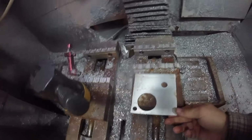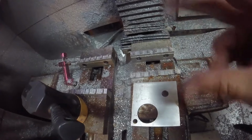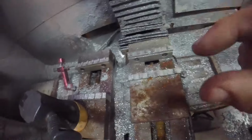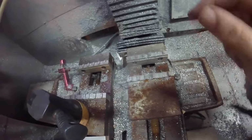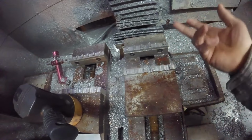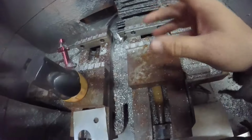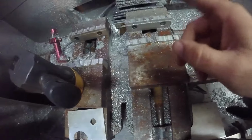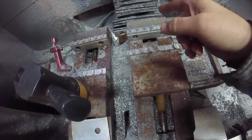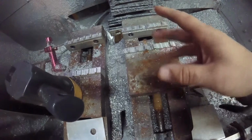So I've already had the ball screw out. Well, I've had the nut off and screwed it back so I could see it once. And it's got a double nut, so they're tightened together to do what they do. And I noticed that it had a little bit of play in it. I could pull them apart. So I used a feeler gauge, figured out how much the gap was. Got me some shim stock, pulled the nut apart, put the shim stock in, tightened it back down, and everything was great. Before, I had just over 20 thousandths of lost travel in the Y. After I put my shim in it, I was down to 7 thousandths, which is still a lot, but way better than, I think it was 22 is what I had.